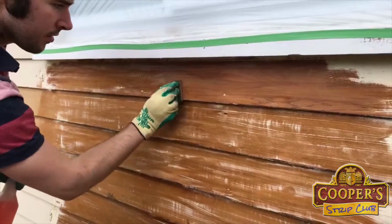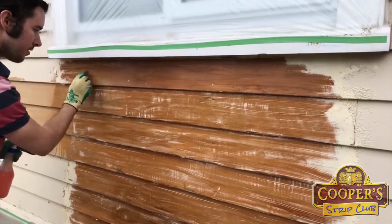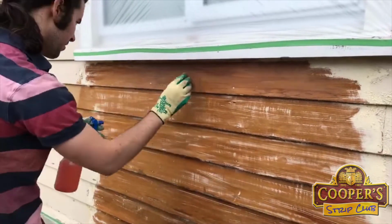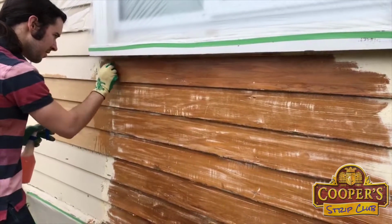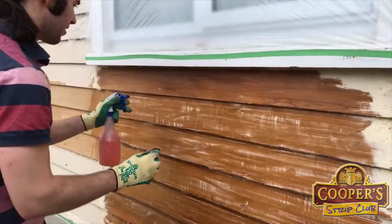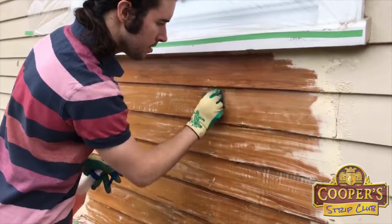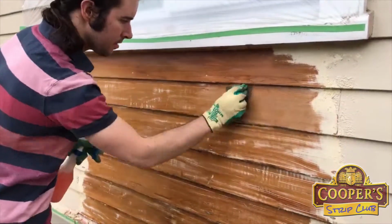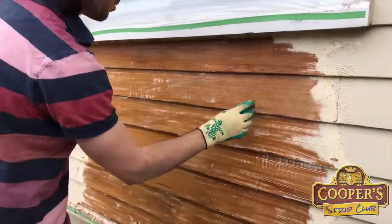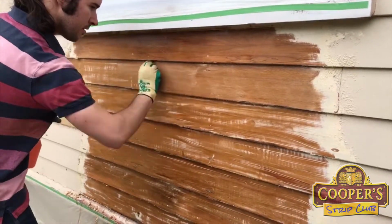This is an English product, a little bit like a Scotch Brite. This one's an English version. It's a little bit coarser. So it's like a nylon pad with a grit that's been embedded into it. That's why we call it a grit embedded pad. And so we're giving it now a wet scrub. So everything's damp. We don't want to scrub it dry. So you see George is giving it the odd puff.